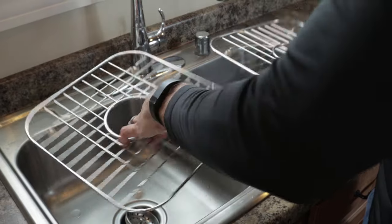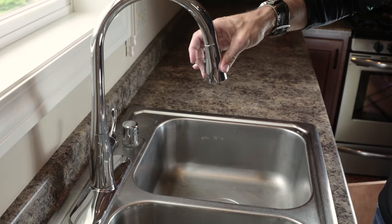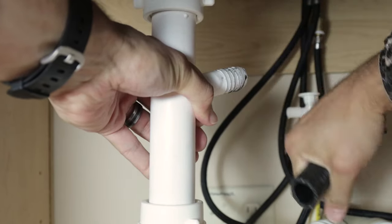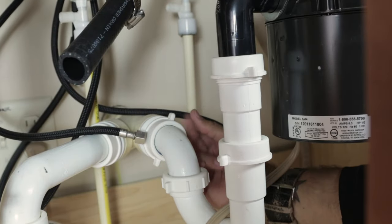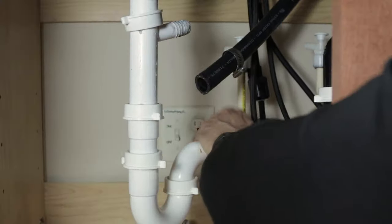Start by removing any accessories in your sink. Turn off the water supply and run the faucet to remove any residual water. If you have a dishwasher and/or garbage disposal connected, disconnect the power to both. Next, loosen and remove the water supply lines to the faucet. If applicable, loosen and disconnect the supply hose from the air gap to the drain. Then unscrew the slip nuts on the P-trap from the garbage disposal and waste pipe, as well as the other sink drain if applicable, and remove them. Have a bucket handy in case of any water remaining in the P-trap.